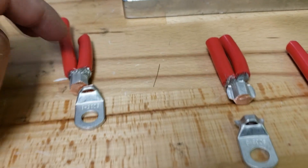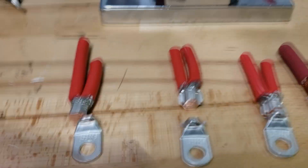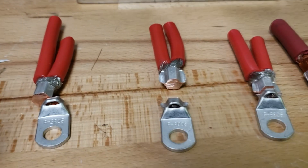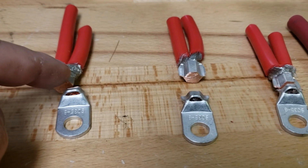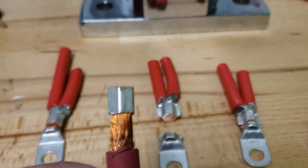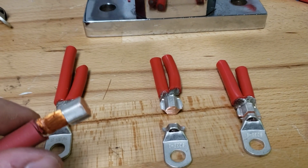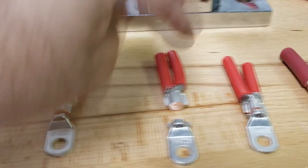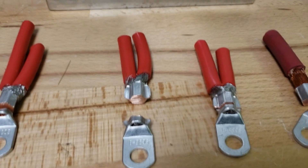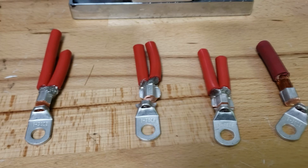Overall, I don't think you'll find a meaningful difference between any method you decide to go with. If you have access to a 25 millimeter die it'll still work — it'll make a little bit of butterfly wings. Half-and-half 25 and 35 millimeter works, and 35 millimeter works as well. The 35 millimeter will probably make the most appealing crimp, but it works best with 2 gauge cable. Since two 6 gauge cables aren't an exact match, you can play with it and go up or down as needed.